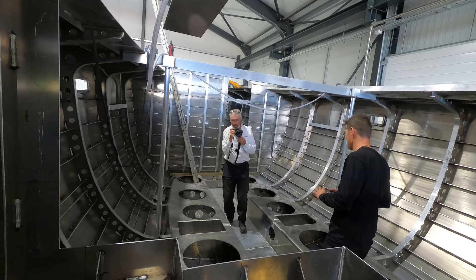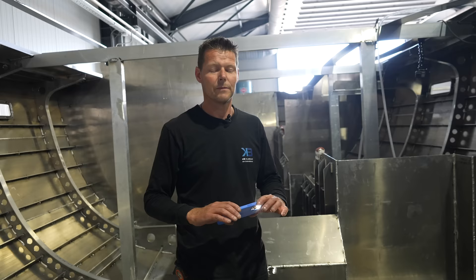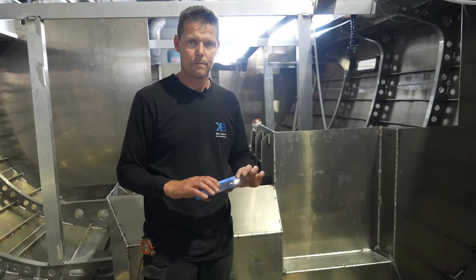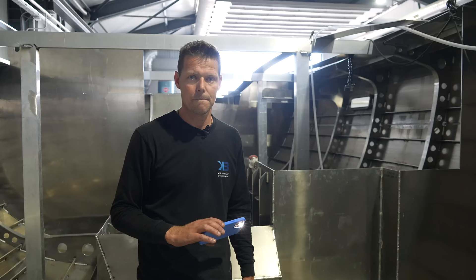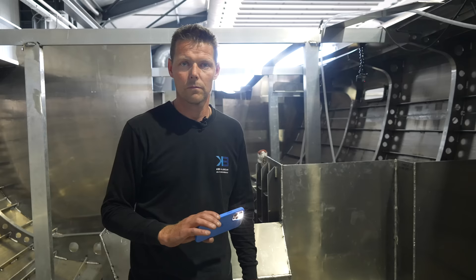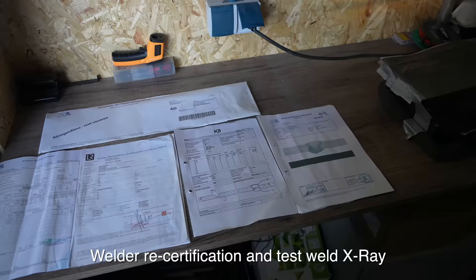So is this a slightly different process because this boat is CE-coded — European Certificate? Yes. But your guys are also qualified to do Lloyd's Register welding, which is a slightly higher qualification. All of our welders have a Lloyd's certificate, and because of that they have to get recertified. They need an update every six months — they need to have welded an x-ray sample.